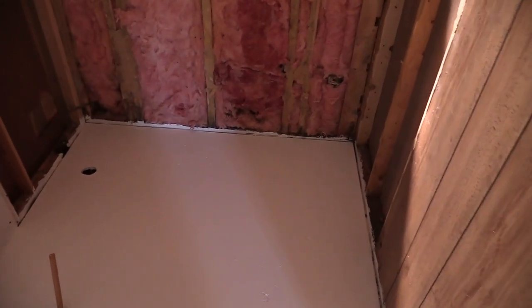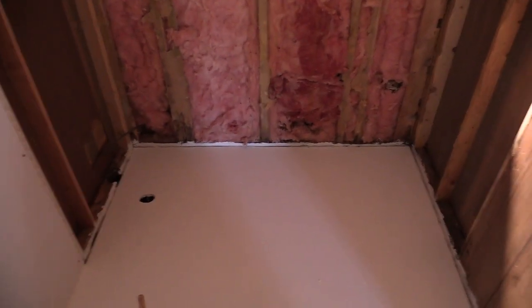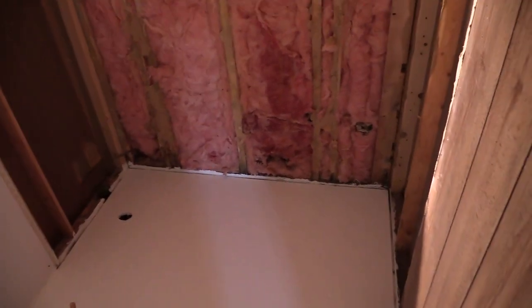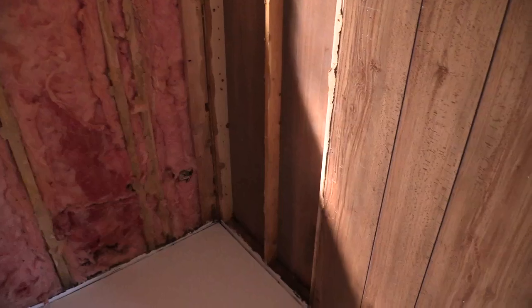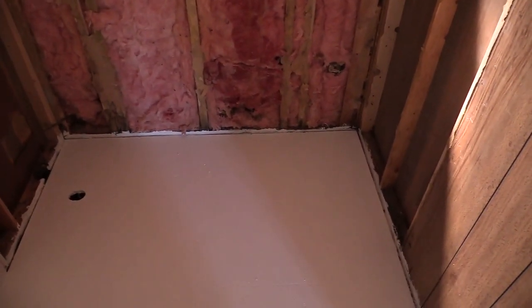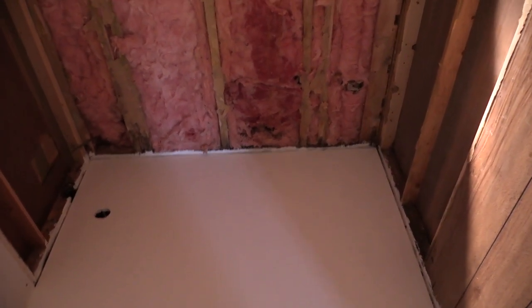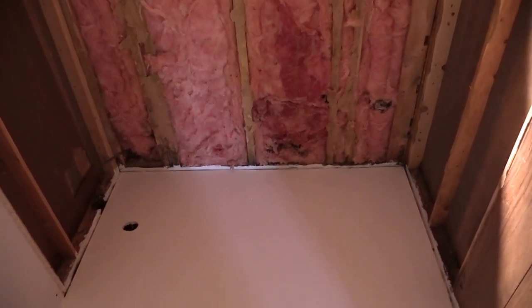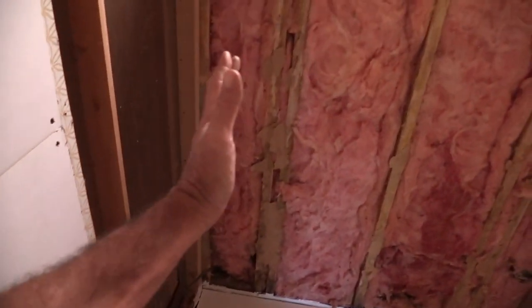This is the bathroom I'm working on today. That's where the tub has to go. It's basically a 60-inch opening but the sheetrock's going to screw that up, so I ended up going with a 54-inch bathtub, which is typically a mobile home size or size for a small space. Today I've got to reinforce the walls with some real two-bys. I've got to raise the tub because of the mobile home framing underneath — it's not conducive for running the drain down and putting the trap in and reconnecting. The old one was raised for the same reason, so I've got to frame that up a few inches and then build a stub wall here that'll have all the plumbing in it.